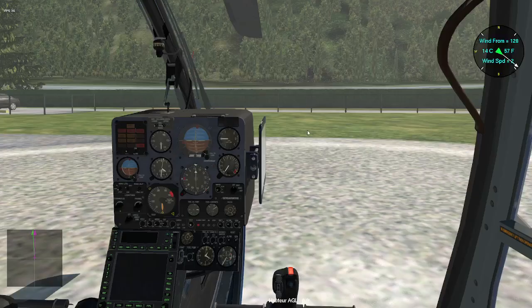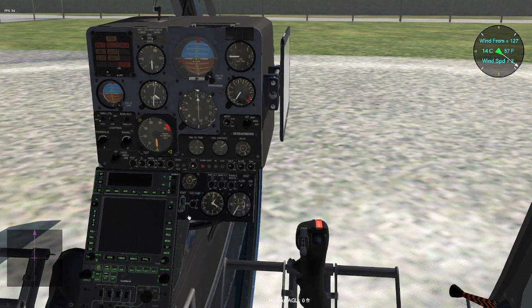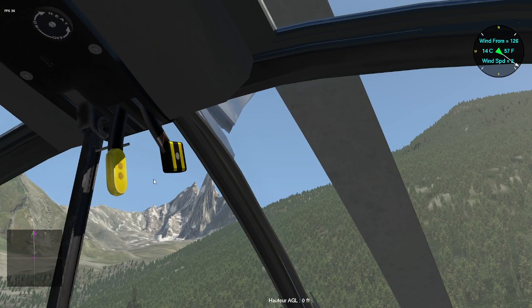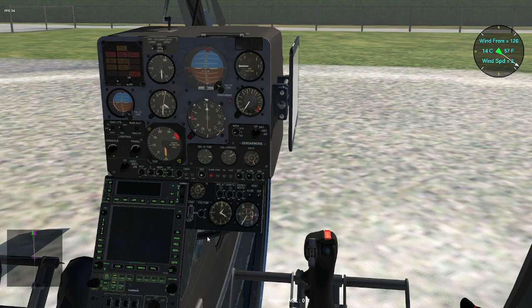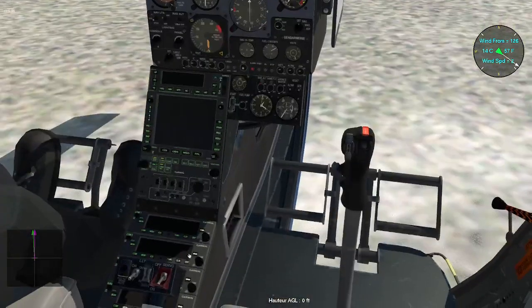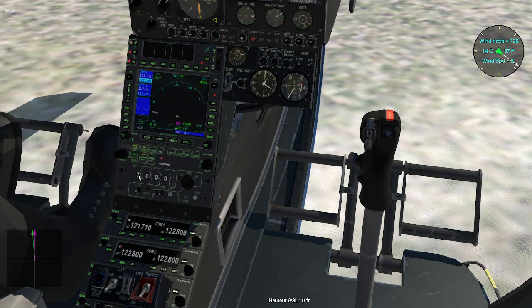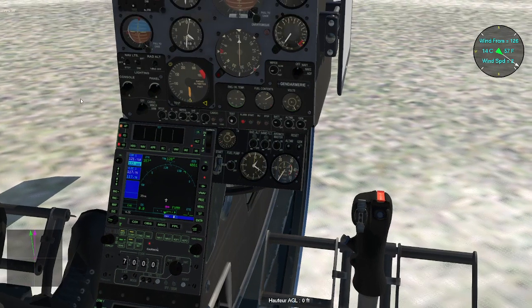So, back in the cockpit, the switch is on. I engage the pump for 10 seconds. That is the procedure. Just as the fuel cut is on position, the fuel is coming into the turbine. At the same time, I put my avionics on and check that the transponder code is 7000 in France for VFR. The standby mode is checked. My GPS is active. My autopilot is illuminated but not used for right now.